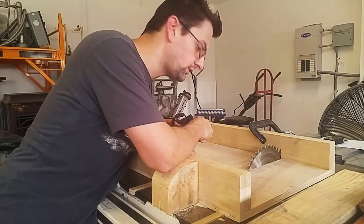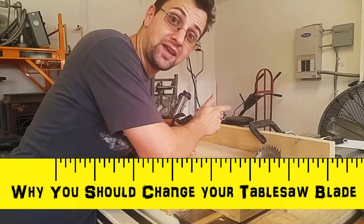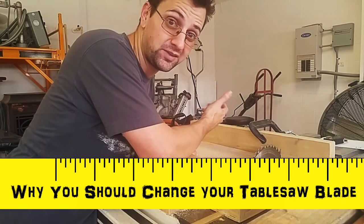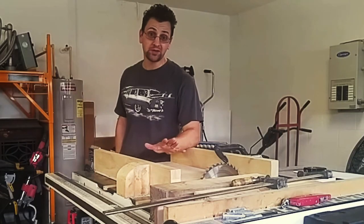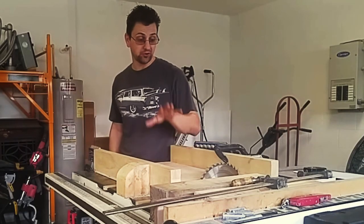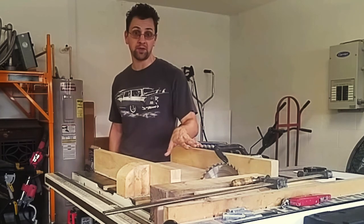This is a really old blade. It's the original blade that came with the table saw when I bought it about 10 years ago. Since I've gotten it, I've filled up that bag about once every six months — that's probably 18 to 20 bags worth of sawdust. Most of that sawdust has been MDF, which is notoriously bad at dulling blades. At no point during those 10 years did I ever clean, wax, or sharpen that blade.